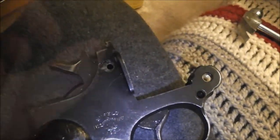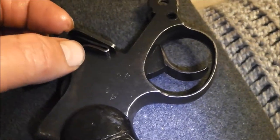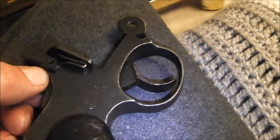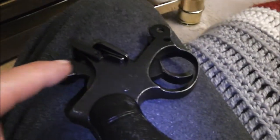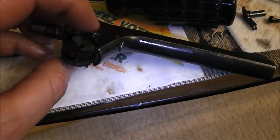The next fun part will be putting the catch on here for the barrel. Cleaned up the spring - got some fifty-year-old Cosmoline stuck in there. Got all that out. No rust, fortunately. The little pin just fits in that hole. Just take this bad boy - I'm trying to do this with one hand - slide them in place. Push against that spring a bit and get the pin right there, lining against the cylinder. Slide them in, screw them in, and that'll be done. Next I'll put this catch back on - slides in place there. It's two shouldered screws that hold that in.